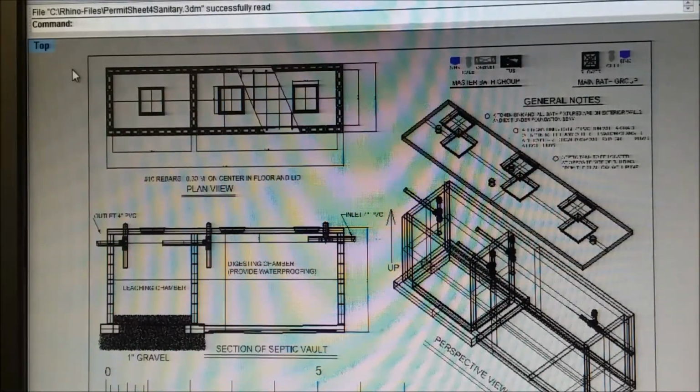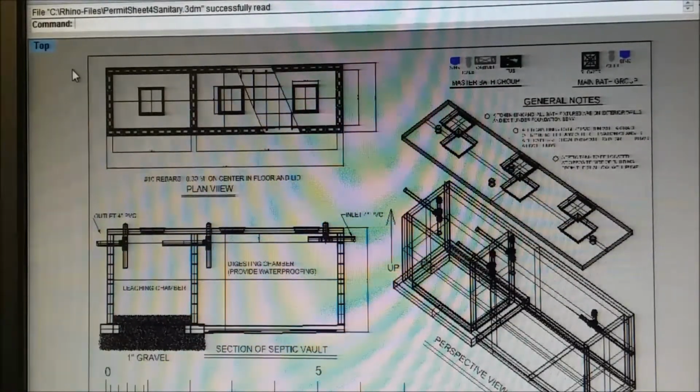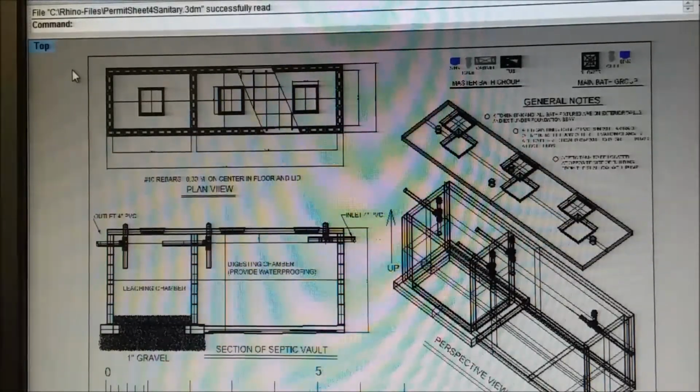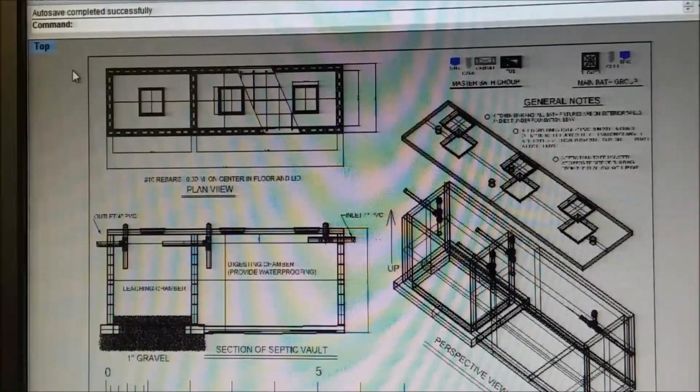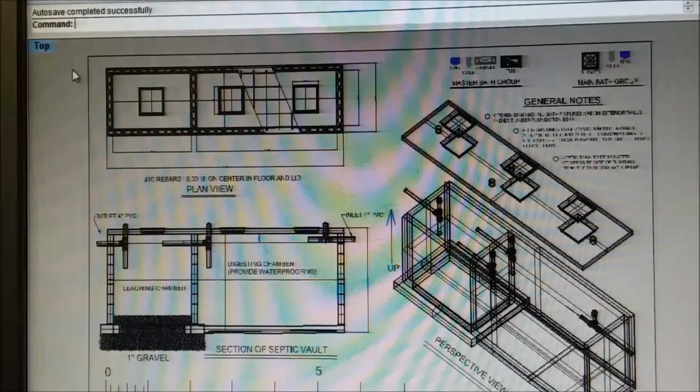Our house being poured concrete, we use bigger doors than we need because it's less concrete. And we put interior windows in the house, like the master kitchen to the living room, entry room kind of thing. We use all our door forms and our big window form in that wall. It sort of connects the rooms. There's a window between the master bedroom and the master bath, and that's another huge window. So those all eliminated rebar and eliminated poured concrete. So they probably paid for the doors. They're less expensive than the concrete. And we didn't have to mix the concrete and made the pour for that day smaller.